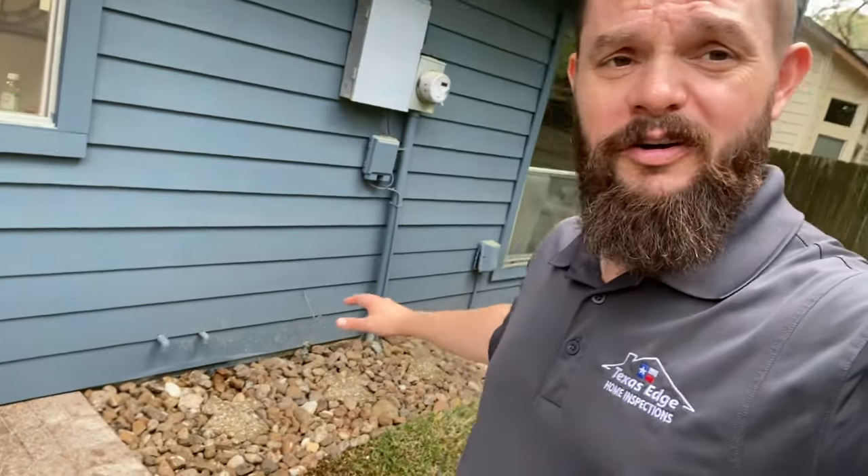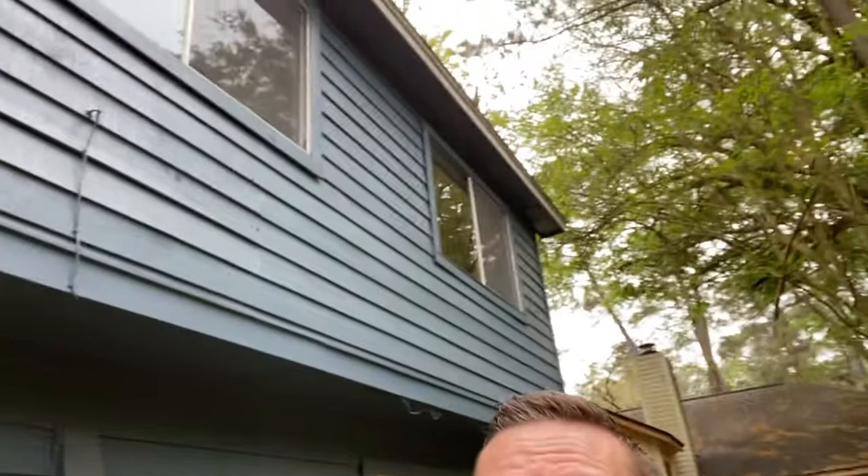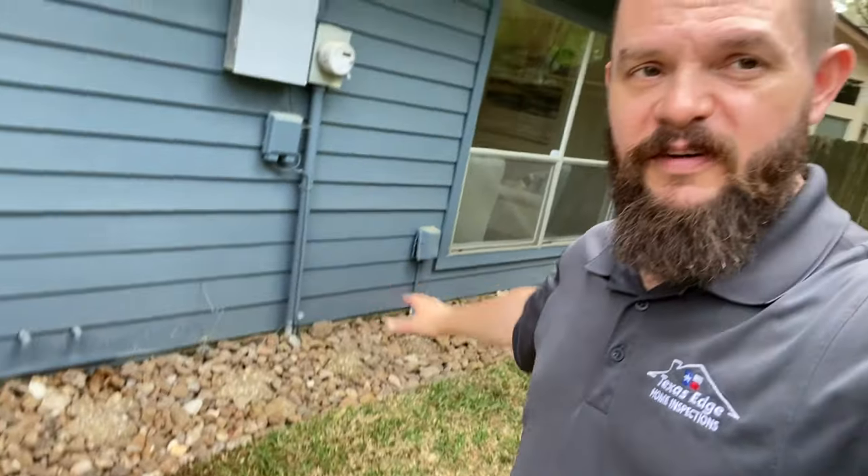When it comes to termites, we want to be concerned about excess moisture near your structure. Not only do we have that line sending water off in this area, but we also have a gutter up here that's leaking water into this area, making this whole section of the house very wet and moist. That is a conducive condition for termites and wood-destroying insects.